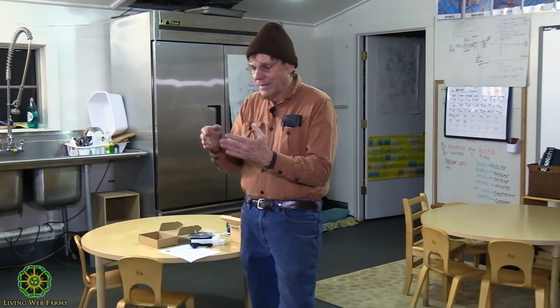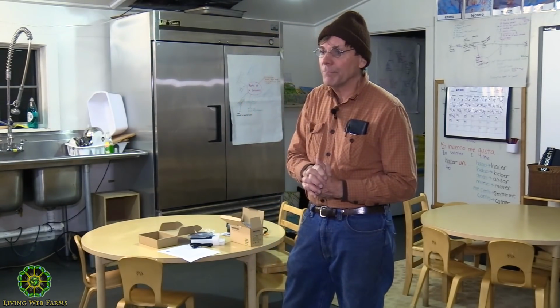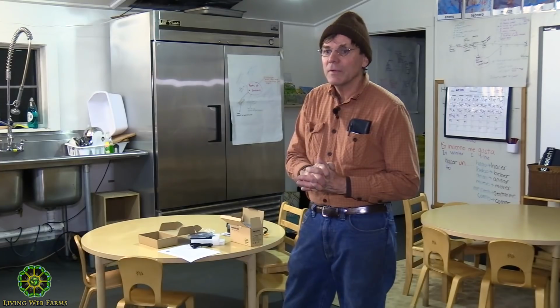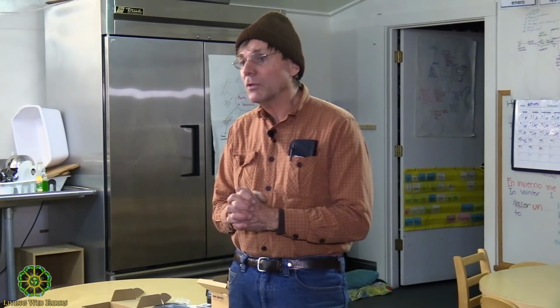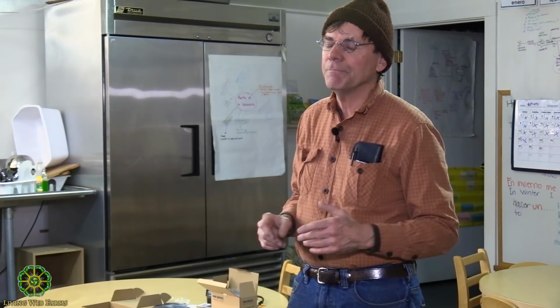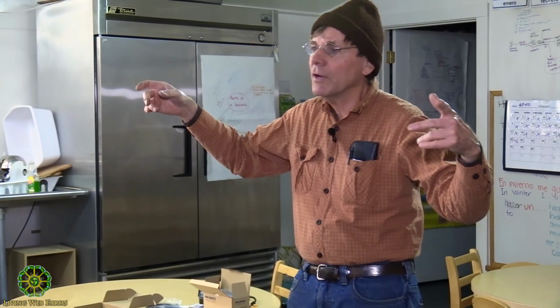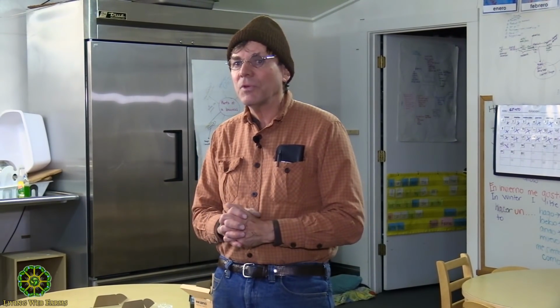If you're going to cut your wood from the tree, if not, you can still find flat 1x6 sized or 1x3 sized purchasable locust around. So that's basically the framing part. There's probably other ways you could do it. Like I said, with aluminum angle iron, you could use angle iron, but you'd have to probably take it out every once in a while and recoat, take the rust off it and repaint or recover everything so it wouldn't just ooze out rust. So I would avoid that.